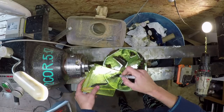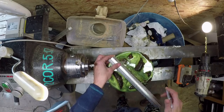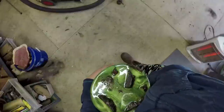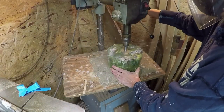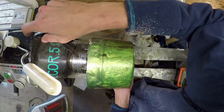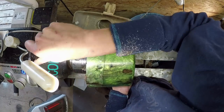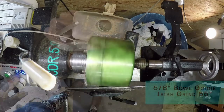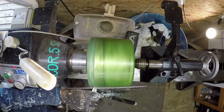I have to confess — with this project I got a little ahead of myself and accidentally drilled a hole in the wrong end. It's almost the same diameter at the top as at the bottom, but I wanted that bark to be at the top of the base, so it did matter. I took it over to my drill press and drilled a 55mm mortise, and that seemed to hold pretty well — it's held a couple other projects fine even without a dovetail cut.